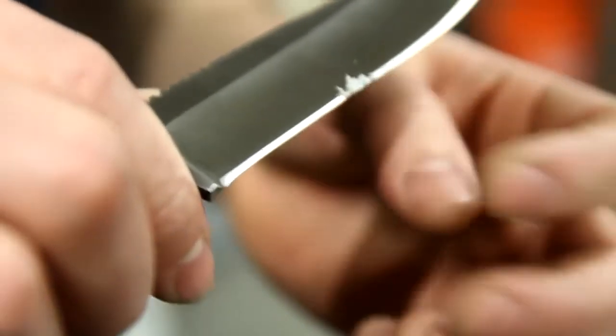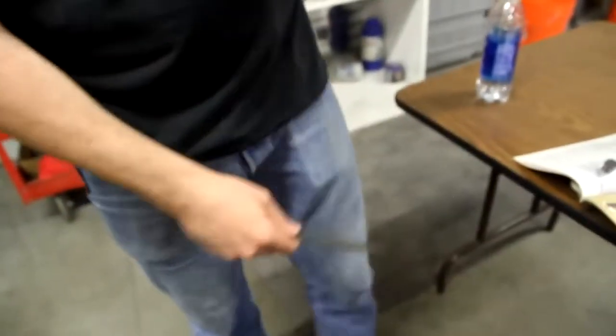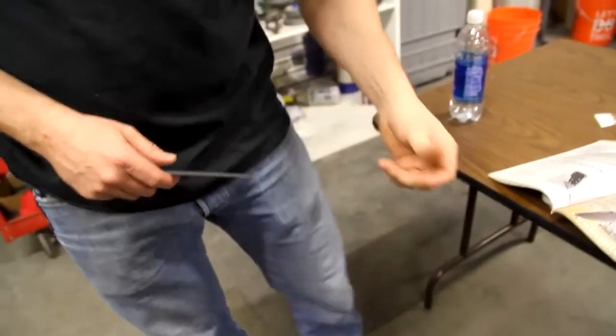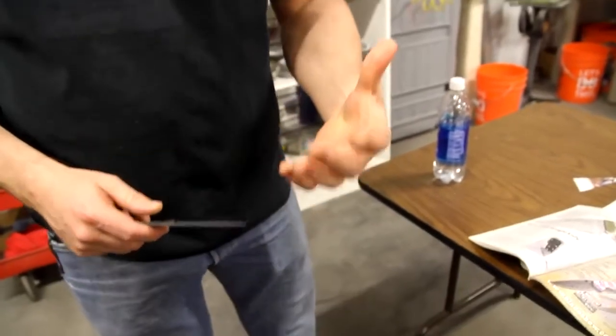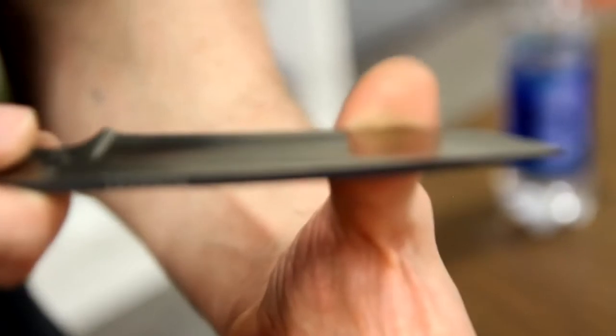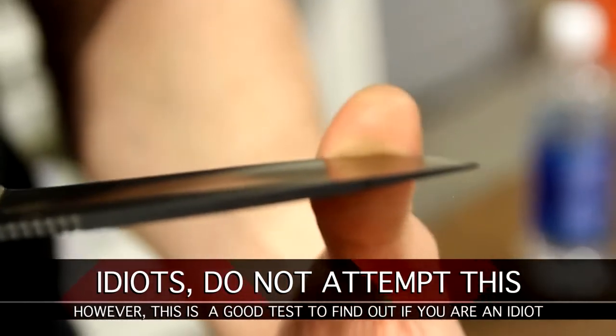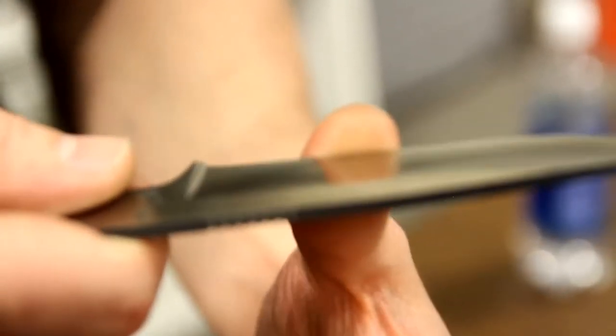Now the thing that I do, I haven't really seen too many people do it. I don't know if other people do it this way, but it's a way I can really feel if something's sharp. First I lick my thumb so that I know I'm about to really clean it up good. I'm going to wipe it on my pants like so, really hard, so that I'm really getting down inside my thumbprint so it's as clean as it can be. And I actually take the edge and I let my thumb go really limp, and I'll grab it, and that same bite, the micro serrations that happen to actually shave the hair, that same bite, when it grabs my thumb, will move my thumb back and forth. I can feel that bite and know that it's a razor sharp edge, and I don't feel any burr on there. I know that's razor sharp. So that's how I check them.